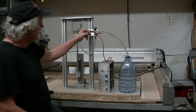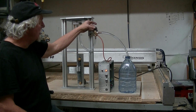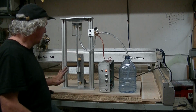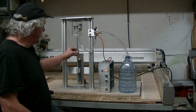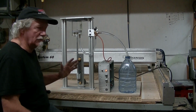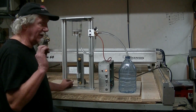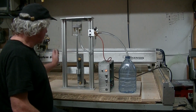Now, here I have just a simple valve arrangement, not a valve, but that's a pressure release. All it is is a weight, and I mean, that could be improved upon. I built this thing in 4 days, so there's a lot that could be improved upon, and I'd welcome anybody's suggestion on how you could improve it with readily available parts. That's the key. You can't say, oh, well, I'm going to order a linear axis here, because nobody's working right now, or very few people are, and you want to wait. We need ventilators right away. We can't wait. So it's basically very simple.